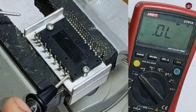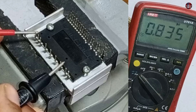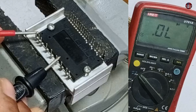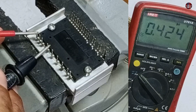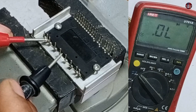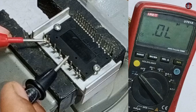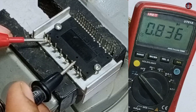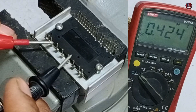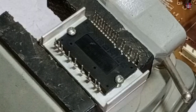These three are the negative pins and these two are not connected. Checking the positive pin shows it is fine with no unexpected value. Testing all the IPM pins systematically — comparing voltage drops against each negative and positive pin combination — all readings are within expected values. This IPM is fine.